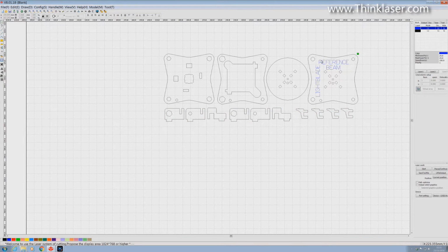Now if I'd have been smart about it, when I selected these parts to go onto this blue layer, at the same time I would have also put them into a group. Now I didn't want to preempt this grouping technique at that early stage, but just remember, when you're selecting parts for a layer, it's very good to group them as well so that you've already got that job done. So let's go back and select my blue parts, shift key down, check that they're all red, and we'll put them into a group. Job done.